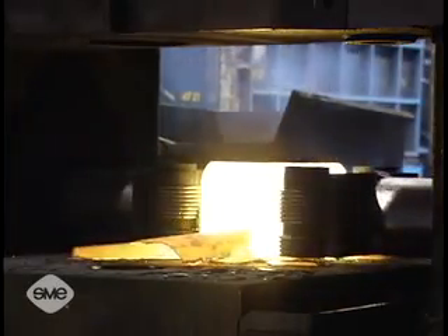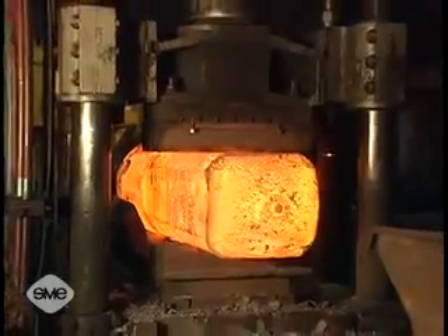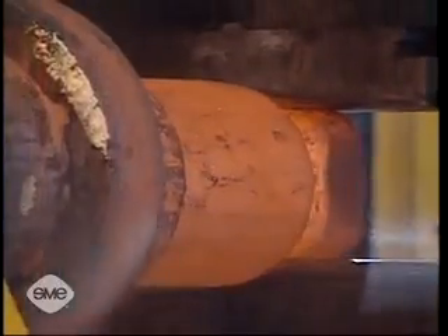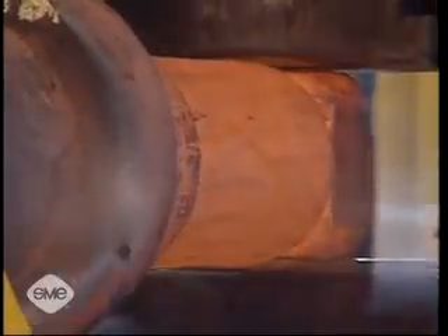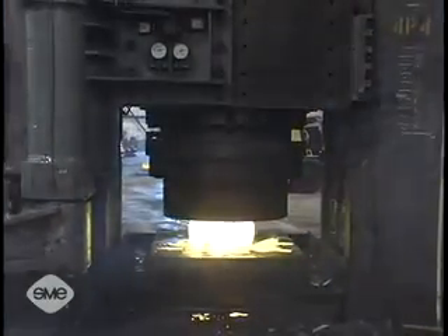This deformation can result in lengthening of the workpiece while reducing its cross-section, upsetting regions along the length to greater sizes than adjacent regions, or bulging the workpiece's cross-section while reducing its length.